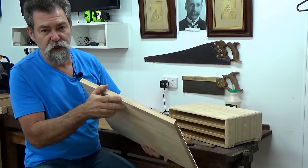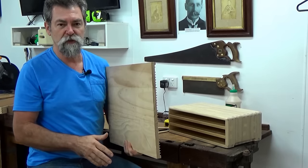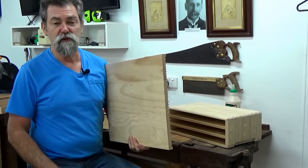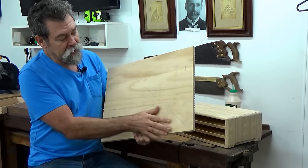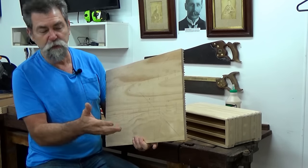This is 18 millimeters or three-quarter inch thick — it normally ends up 18 millimeters in Australia because it's all dressed. It was probably out of three-quarter inch stock, which is 19.05 millimeters, so it comes at 18mm. The width was around 135 to 140 millimeters each.